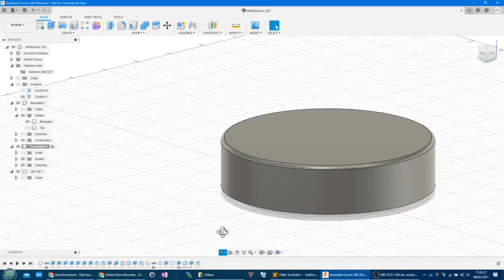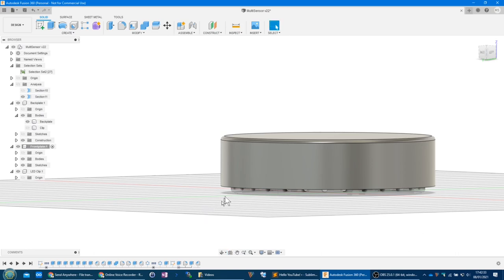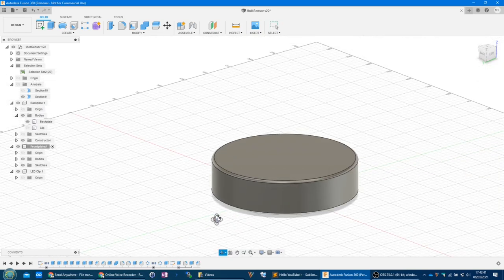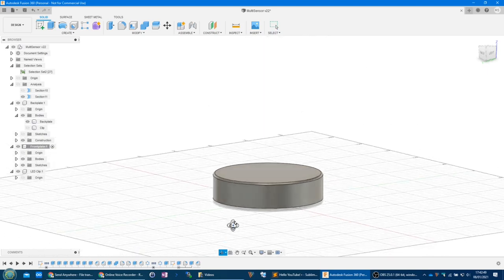And then air can kind of get under here, and perhaps you put even some perforations. You can see it doesn't go flush with the ceiling, so air will be able to hopefully freely flow there. That's the idea with that. So we get nice readings from the temperature sensor, and they're hidden. The difficulty obviously is getting nice readings that are hidden, because you could just punch a hole in that and whack your sensor through, but it'd look rubbish, wouldn't it? So that is the idea with that.